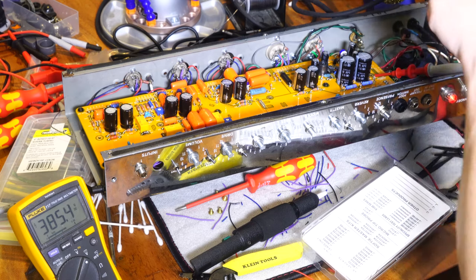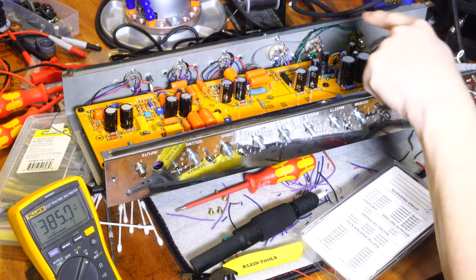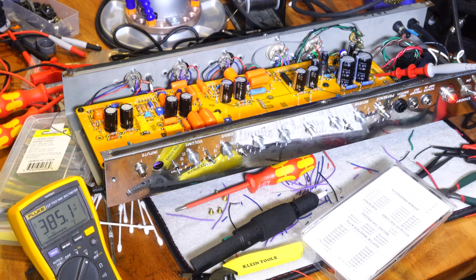So again, like I said, we've got 380 here, but because of the pair and the way those are balanced, it can take double that voltage. That's why a doubling of these capacitors is nice, because they give you effectively double the voltage rating of what one of them would be, theoretically. In practice, it's probably less than that by some margin because of imperfections. 400.